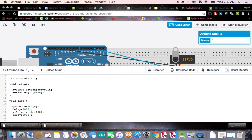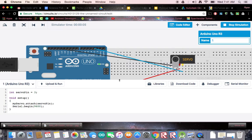And that's the code, guys. It's pretty simple code today. We need to learn how to make a sensor make this move, but first you have to learn how to make it move without any sensors. So by forcing it to go to position zero, we should see it go to angle zero, and by forcing it to go to position 180, we should see it sweep over to 180 degrees. And there we go — it's sweeping nicely. That's what we're looking for. Thank you very much, guys.